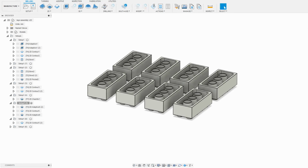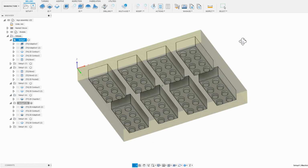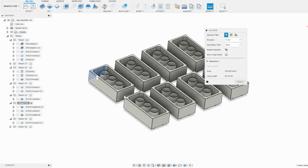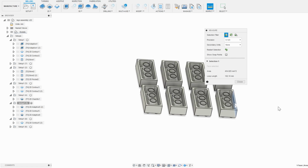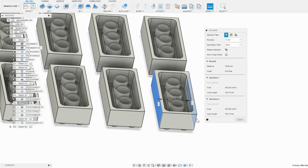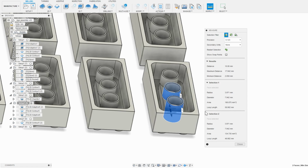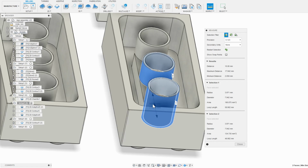So I've got this piece of aluminum that I've modeled in Fusion 360, and I figured I could just fit 8 blocks of Lego inside of them. These aren't standard sized blocks. I designed them myself to be approximately 20mm by 40mm. They're a tiny bit undersized, that way they can actually stack side by side with a tiny clearance gap between. The pitch of the Legos, or the spacing between all the round mating components, is exactly 10mm though.